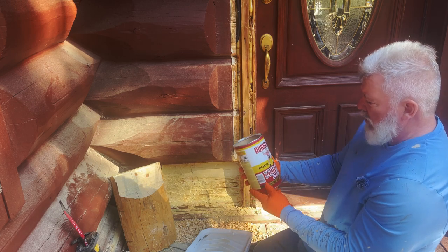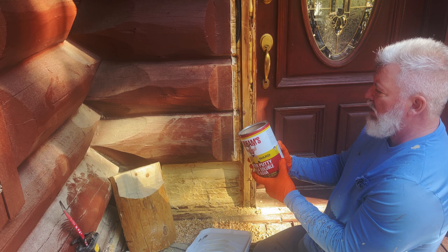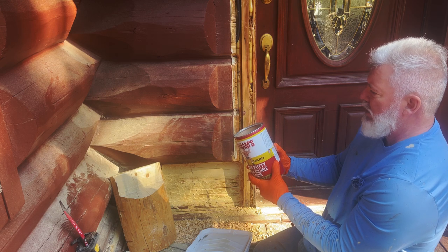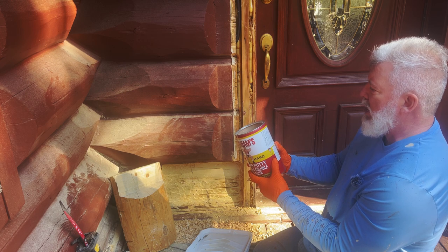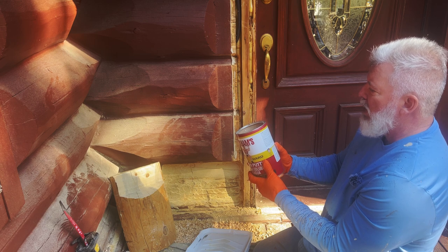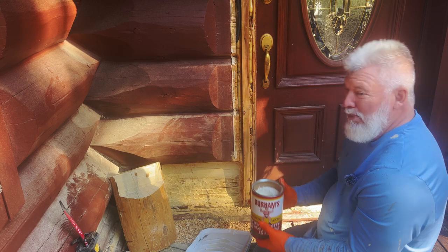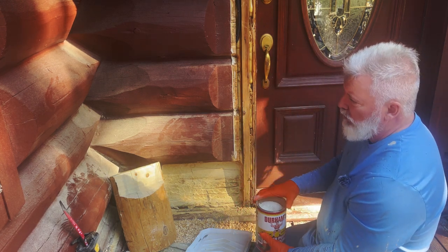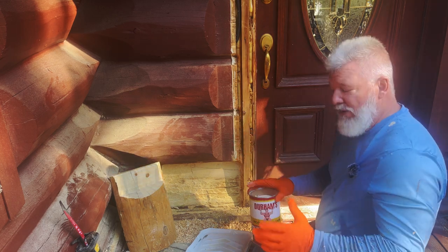Now, this stuff will generally paint. I'm not real sure about the staining. Yes, it says it takes most surface stains, and it will take water-based stain and water-based paint. Do not mix with any oil-based materials, or the putty may not harden. You can actually mix some of your paint into the water putty, which is really kind of cool. It'll give it that stain, and then you can go that color and then go over it. A very cool thing.